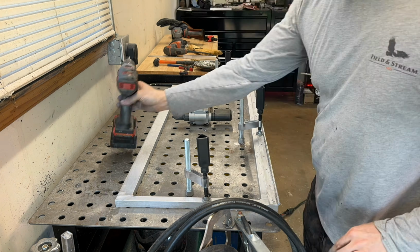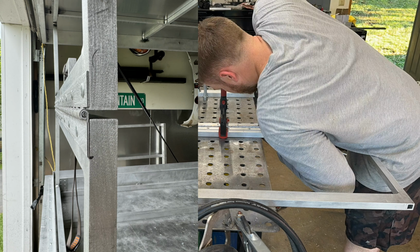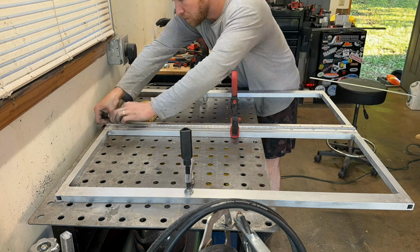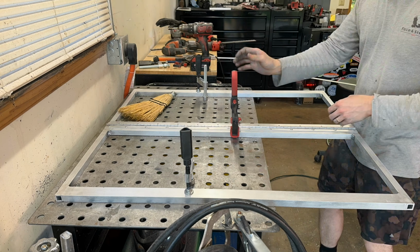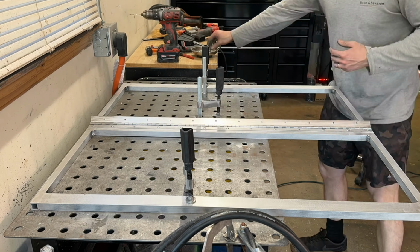When lining up our other side on the hinge, we want about a 1/4 of an inch gap of empty space in between both hinges. Go ahead and do 2 test holes, get the rivets in, and fold it over, and make sure that both of your edges line up evenly when it's folded. If not, this will interfere with the process of raising and lowering the camper.